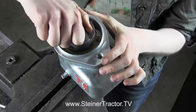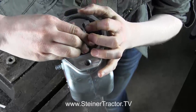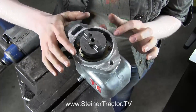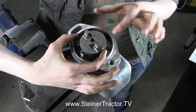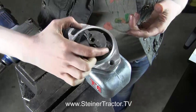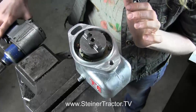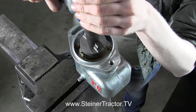This is probably the hardest part of the magneto — you set this down and have to set the spring. You kind of have to lift the cover up enough to go over top of those weights while still keeping the weights in there. If the weights pop out, you can use a screwdriver to tap them back in. You'll need to turn it probably one to one and a half turns until it snaps on correctly. Once it's on, you can tighten it up with the washer at the top.